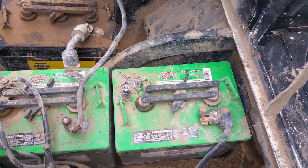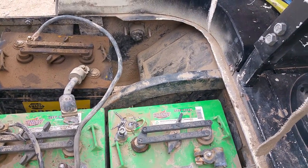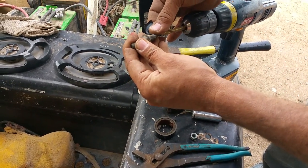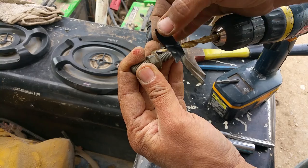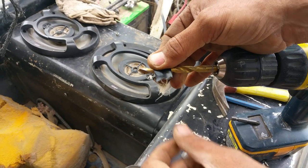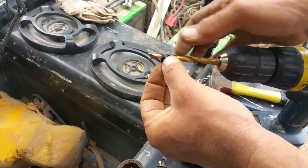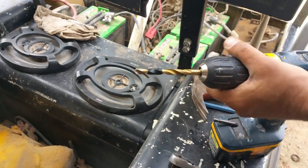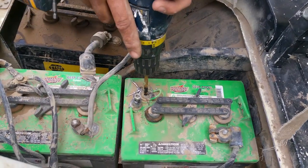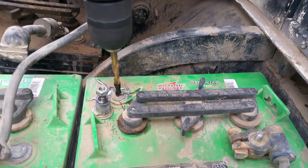Let me show you the tape technique in case you need it. What I meant by the tape is that you're just going to want to go the depth of how much of the stud you're putting in there. So if we went that depth, we would be good. Wrap the tape around the drill bit and just drill to that depth. Normally I'd eyeball it, but you might need it. So we're going to go down to the beginning of the tape.